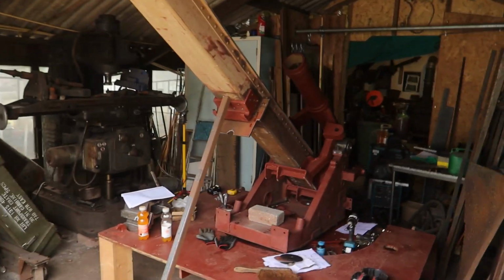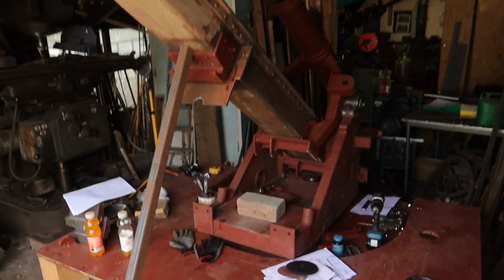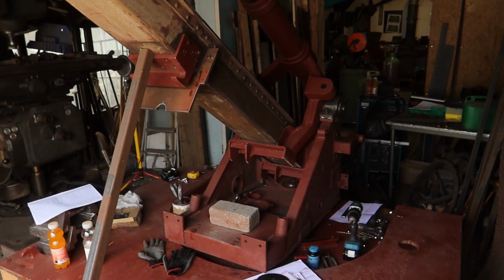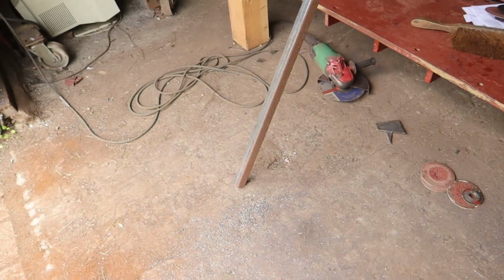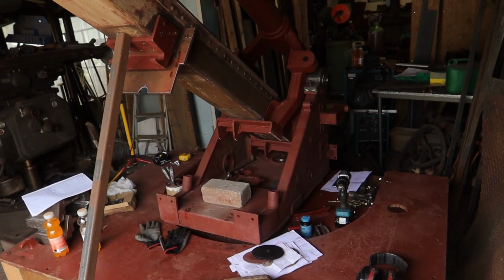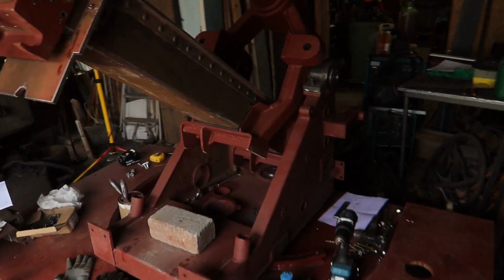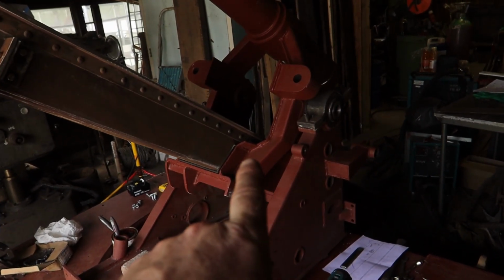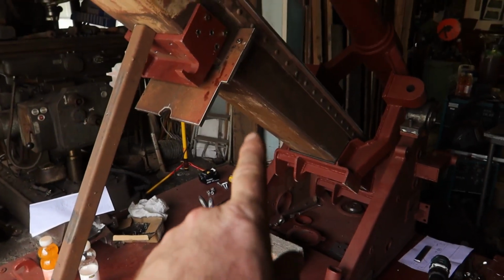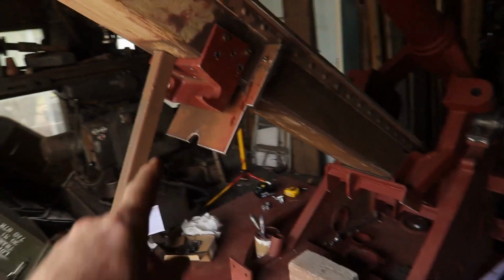So I have lifted up the elevation, propped it up with a bar, would put a clamp in front of it so that it can't slide away, as well as something on the floor, maybe even tack weld it, so I can work on the underside. So I have enough room for drilling all the holes and all the extra rivets here.